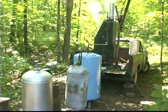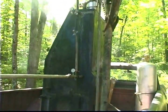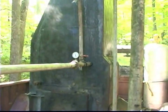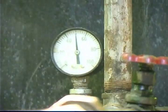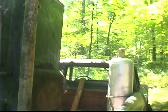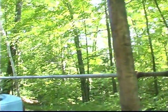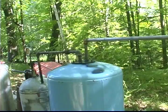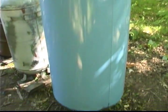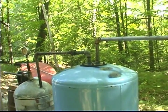I'm making gas right now. It comes from here — got 50 pounds of pressure of the gas. You can see it's leaking a little bit under that pressure; there's smoke coming out of this sealed vessel right there. Then it goes over to here — this is the water — there's a bubbler in there, a piece of pipe that goes down into the bottom, and it's about three-quarters filled with water to cool it off.